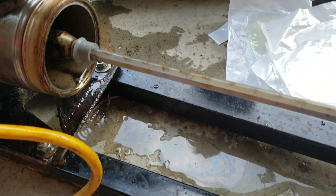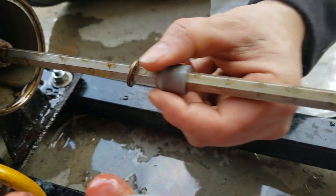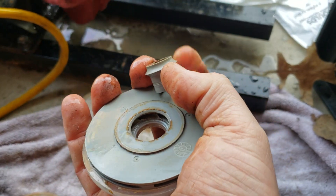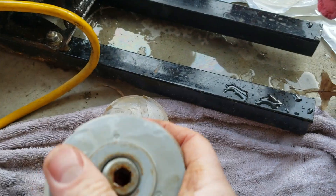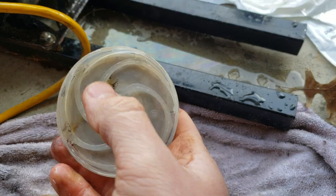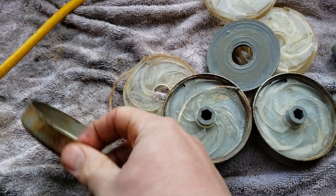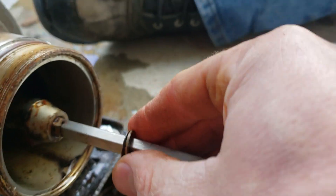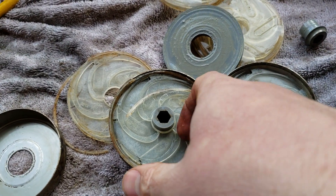That's a first — check that out. That's probably what's jacking them all up. This one, the one that was all the way on the inside, has completely come apart — completely, and pretty cleanly at that. See, that should be right in there but it's broken. So this is why: don't just get the diffusers, get some of the impellers too. I think I have like two of the metal shrouds just in case, but those are pretty heavy duty. And again on here we've got the initial part of it — this doesn't look like it has as many washers as the other one; the other one actually has nine on it. So we'll clean all this out and just replace all the diffusers since some of these were as bad as they were.